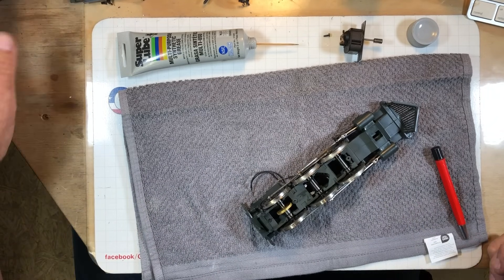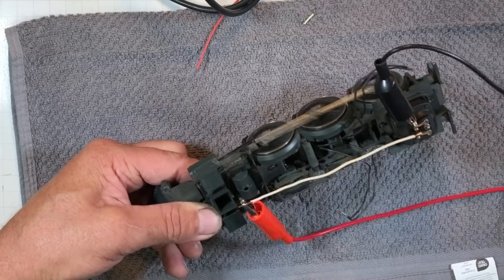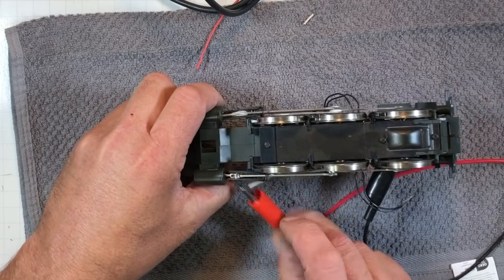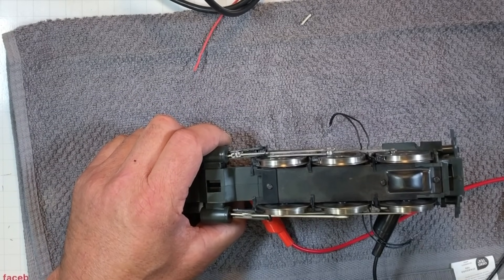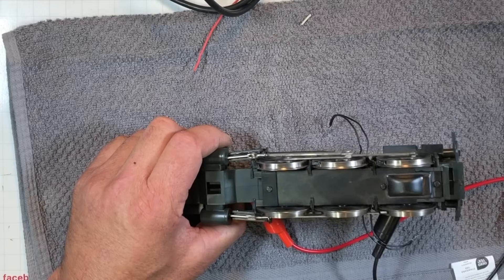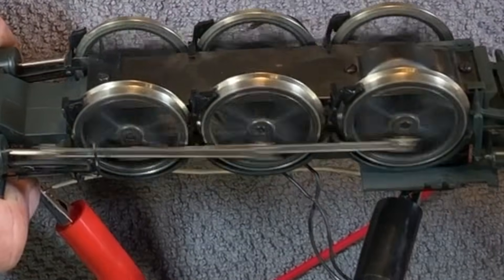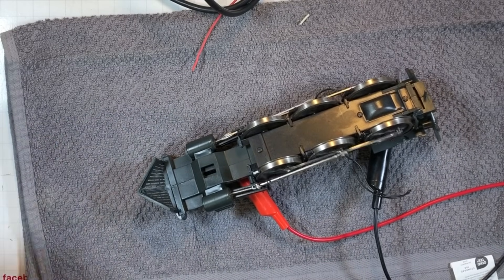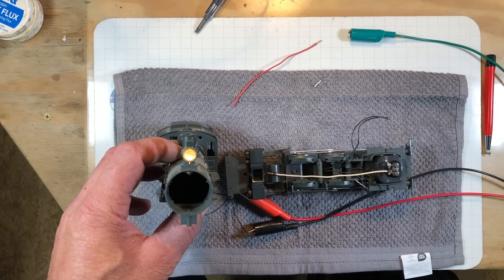That's what I'm hoping for. Put the gear case cover back on, soldered a wire on there just so I could get something to grab onto, hooked up to the transformer, and we are at a hundred percent right now — just full governor. What does this thing output? 15 volts. I suppose that O gauge motor probably goes up to 21 volts. Look at the precision engineering. I'm going to give her a little time, just bucking like this — loosen up some. Looky there, we even got an operating headlight on it. Do a little creative wiring.